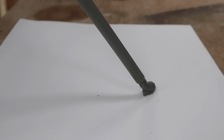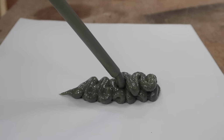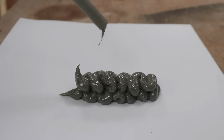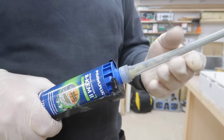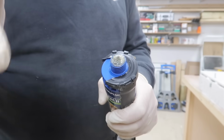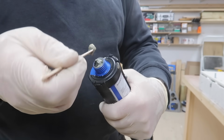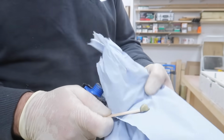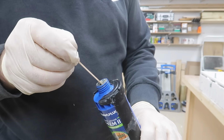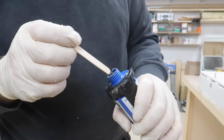While I have the material in the gun, I decide to squirt out a lump so I can see how strong it is once it sets. I haven't used all the resin in this cartridge yet, so I see if I can clean out the top where the two chemicals have mixed to allow me to use it again. One of the chemicals is in a bag in the cartridge, the top of which is about 1/2 inch from the opening. So I clean out all the material to that point, so hopefully the two separate parts will be free to flow out again.